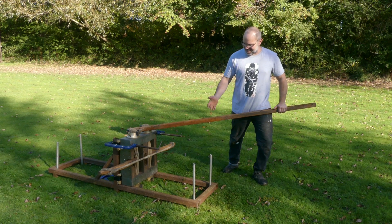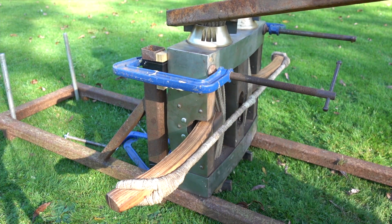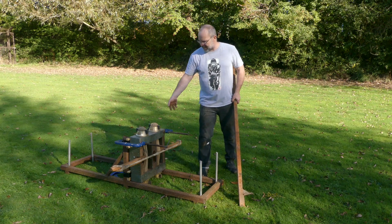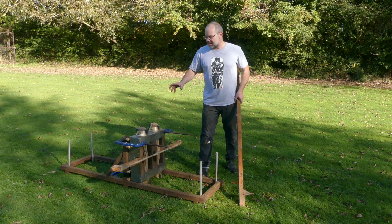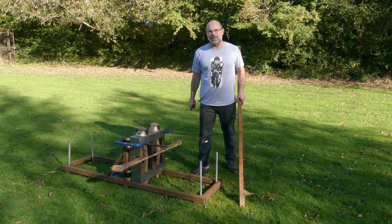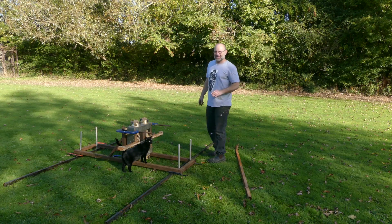I made this 10 years ago — I must have been more stupid then. I'm going to clamp some crossbars on it. Watch the movement of that arm and that arm. What I'm doing is increasing the power on this side, pushing the arm around — so you have to balance the system. Ideally both sides are exactly the same; realistically in a handmade object they're not. So you turn one until the string is straight, turn the other a bit more, keep going until you've tightened them. Then flip the whole thing over and do the bottom bundles as well. I've got my two crossbars in now and can finally start winding up the power.